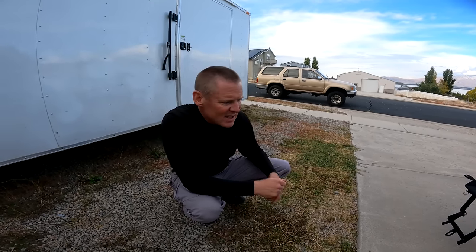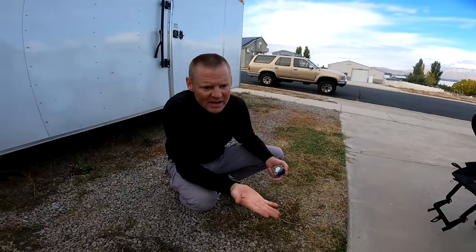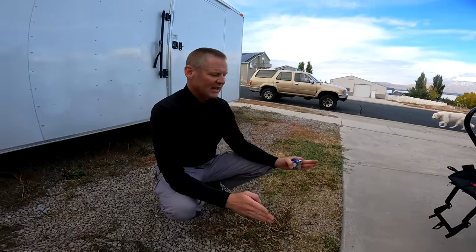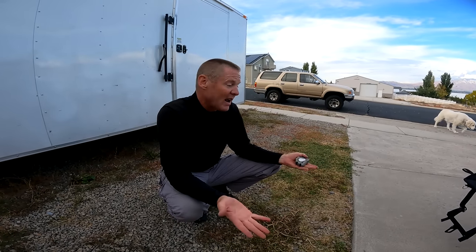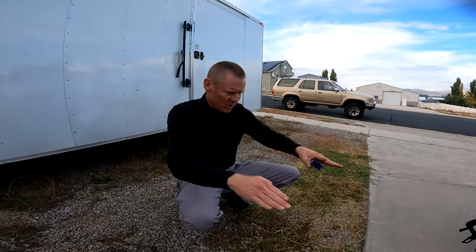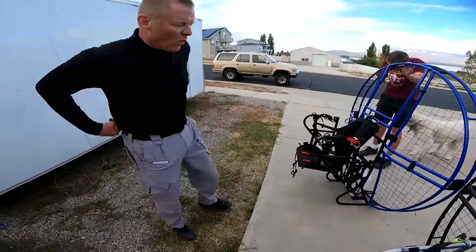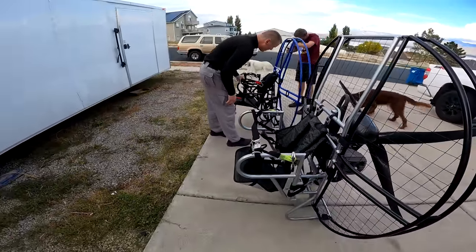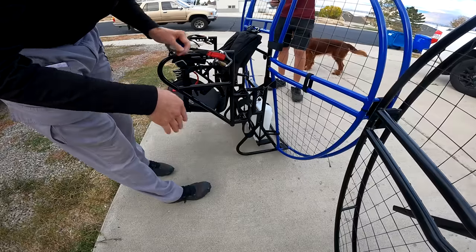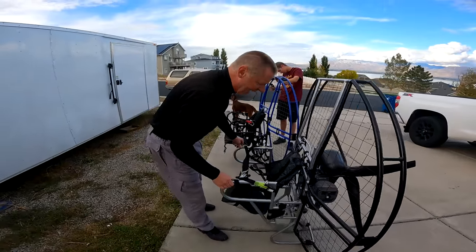Straight skids are more likely to hit the back of your legs. The flat top skids are toed out very specifically for strength, the way it works, and for crumple zone — they're designed to smash and crush on impact. The competitor skids are basically straight. The flat top's footprint is over a foot wider, which is another reason it's so much more stable. And on a flat surface, the flat top skids are completely flat — the competitor rocks because the skids are different angles, not machined to that level of precision.